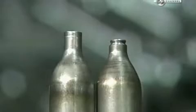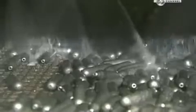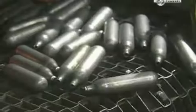As the diameter of the neck narrows, the tube takes the shape of a bottle. Now, each cartridge goes on a lathe. A cutting tool plunge cuts the neck to shorten it. Then it carves out a lip. The cartridges now head through a washing station, where soap and water get rid of the oily lubricant. A trip under some gas burners dries them off, and they head to the filling station.